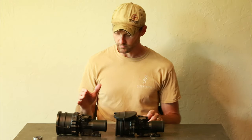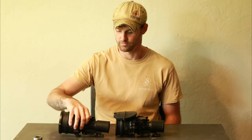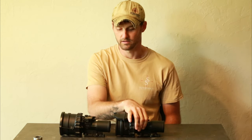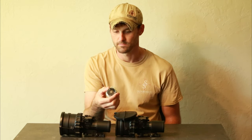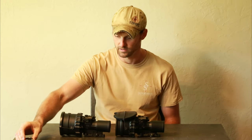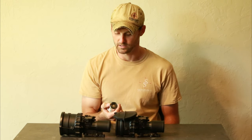Recoil rating — these come from the factory with a BMG recoil rating. Put it on anything; you can mount it on a Sherman tank barrel if you want. But these that I'm retubing, I wouldn't say that — and here's why. The tubes in these FLIR units are F98-15 WGs. The main difference from tubes in Omni-7 PVS-14s or PVS-15s is these WG tubes have a much bigger halo.